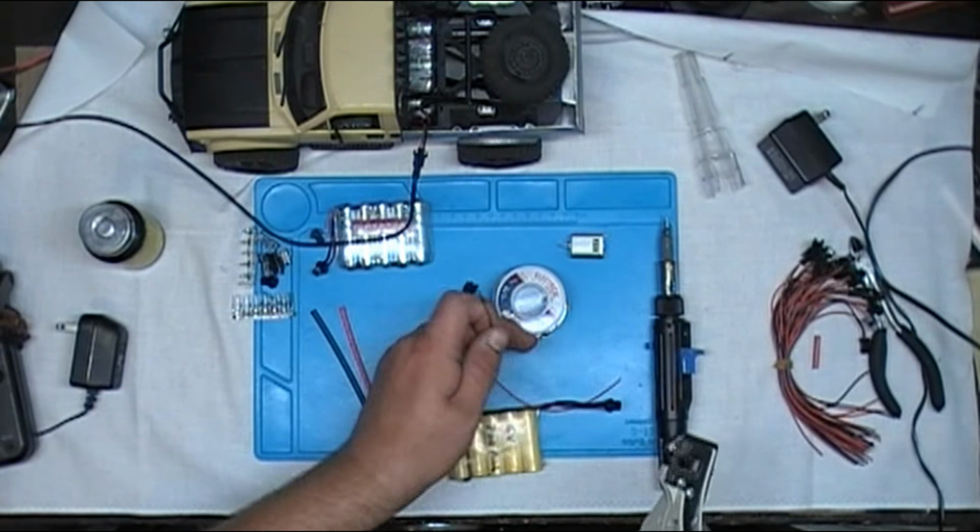If you find an AC adapter, there is a chance it does not work or it does not function properly. And there is one way to test if your AC adapter is working if you don't have a multimeter. It's only 6 volts, so you're not going to get shocked by this. So don't worry, I've got the wires stripped. I mean, I can touch them together and it's fine. But now that it's plugged in, if your motor spins, it works. Now if it just sits there and kind of buzzes or doesn't do anything, don't use that one. Now what you're really looking for on the AC adapters is where it says Class 2 transformer.